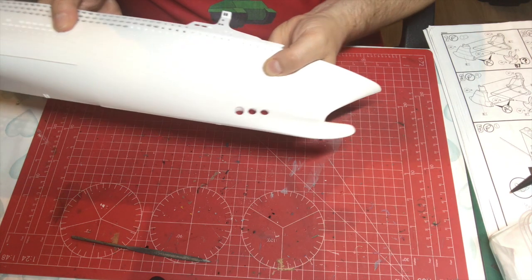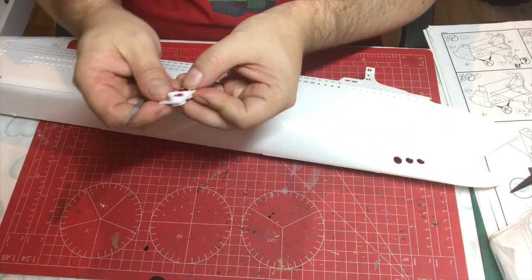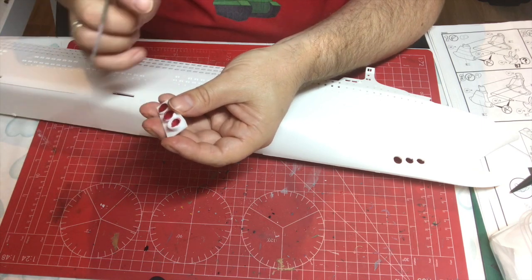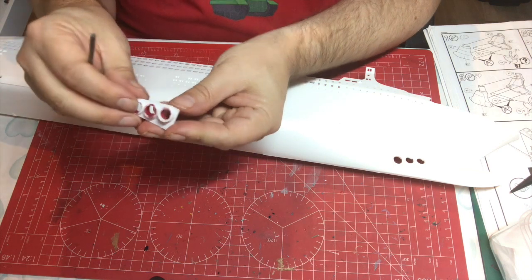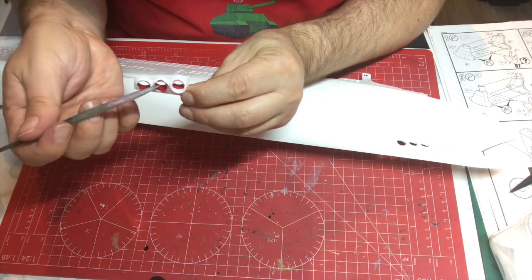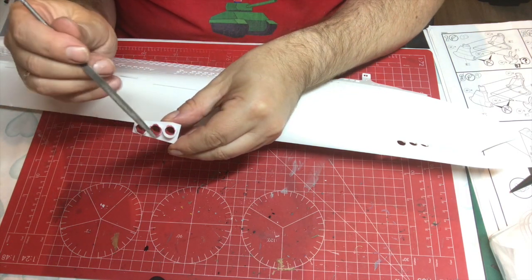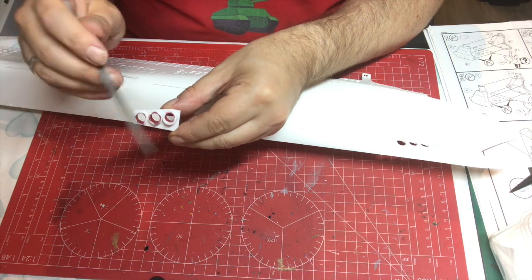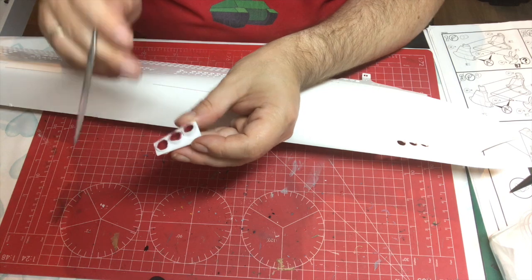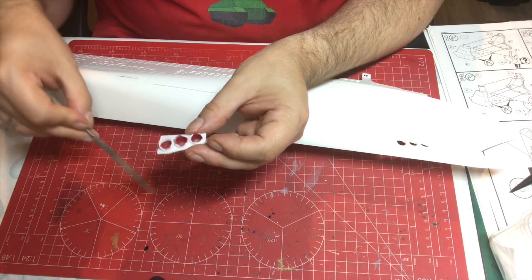And then once we've done that, we have taken the file and put a chamfer on the inside of the tunnel so that it meets up with this top edge here. And you can see by the amount of material that's been taken away from this edge right the way up to that line, it's about, I'd say, 4 millimeters at its deepest point that we've gone back on the chamfer. But by doing it gradually, it's not noticeable, and when it's painted and the door's in there, you won't notice that we've widened the front of the tunnel and that the tunnel's in actual fact getting slightly narrower as it goes along. So that's quite an easy solution.